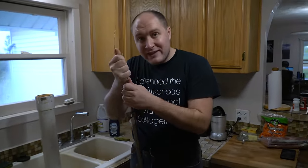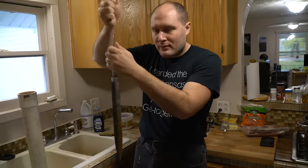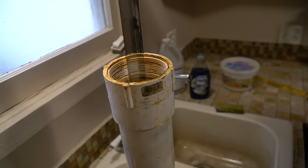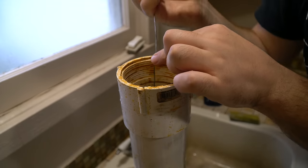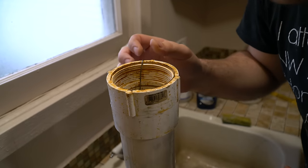First we're going to put it in there for about 60 seconds and then take it out and sand all the oxides off. That way if I accidentally had any oil on the surface we'll be getting rid of that and we'll have a perfectly clean blade. Make sure the blade is completely submerged in the acid, not the tang.